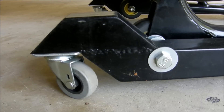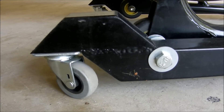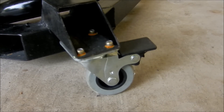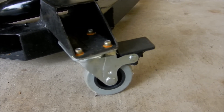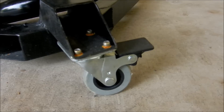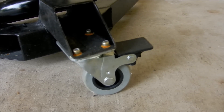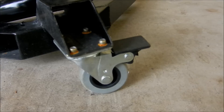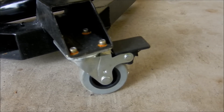The box section — the bottom of the box section sits pretty close to the ground. I used three casters to make it stand more like a tripod. It's much easier to get balance out of three ground contact points than four. I only bothered with a brake on the rear caster, because one brake would be enough to stop it from sliding around too much, and it's only used on flat ground anyway.